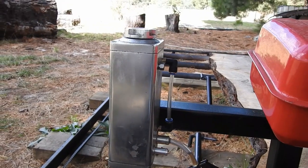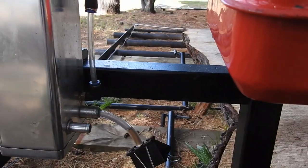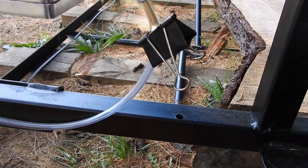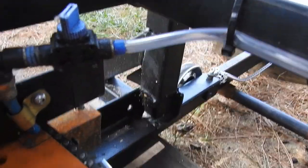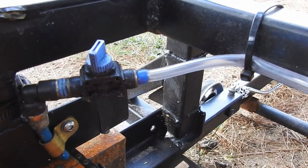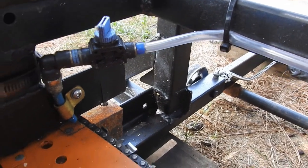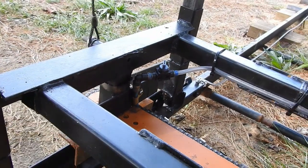Let's take a closer look at everything. This is the oil can with an oil level indicator so I can see how much oil's in there. It comes out through this tube with a highly scientific stop — a paper clamp — goes down to the pipe and then straight onto the chain. It's actually an airline switch, and this switch can graduate one way or the other to give you more or less oil, keeping that big bar nice and lubed.